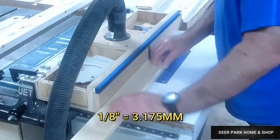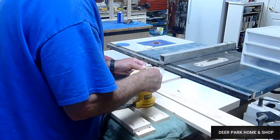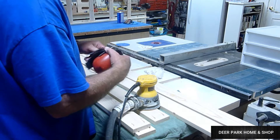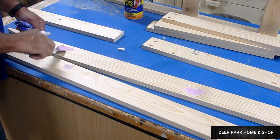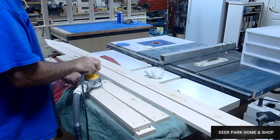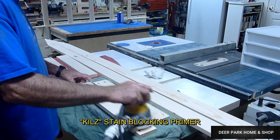Before sanding, I used a one-eighth inch roundover bit and eased all of my edges. Removing those sharp edges is better for your quilts and a rounded edge is also safer if you have young children in your home. Before laying out the positioning marks for the ladder rungs, go ahead and sand all your pieces smooth. That way when we make these marks on the board, we can just install the rungs and then remove the pencil marks with a little denatured alcohol — that way we won't have to disassemble them again. First I puttied all of the knot holes and any irregularities in the board using a product called Drydex — it goes on blue but dries to a white color. When that was dry, I used a damp rag to raise the grain, then sanded with coarse, then 100 grit, then 120 grit sandpaper. When done, I sealed all of the putty knot holes with Kilz Stain Blocker.